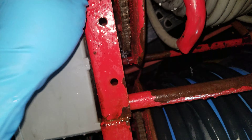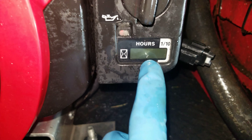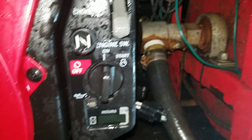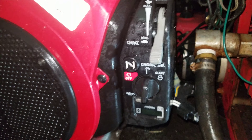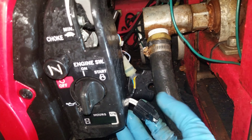I check to make sure. This hose reel is on the same battery — that one is too. We made sure we had gas. The big thing: when you flip this right here, it should show your hours. It should immediately get that, and we're getting nothing. So you start off making sure you've got power. We checked that — came back plenty. We went ahead and actually tried running jumper cables from the positive and negative terminals to the same spot, made sure everything was nice and tight. That was fine. Again, you've got plenty of fuel.